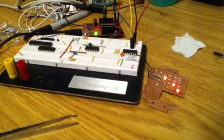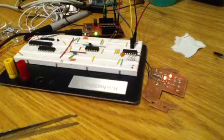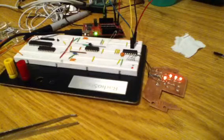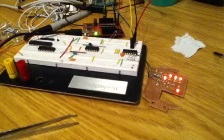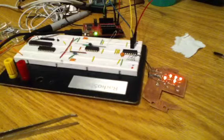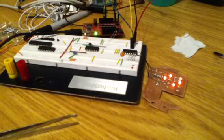My second version design, which was to fix the problems that I was having with this board, allows you to configure it to show either Arabic numerals or letters on the display. This is an LED matrix display, but I wrote my own font to be displayed in 3x4 pixels, so it's able to be run on a display of this size. So you can display numerals, you can display binary horizontally, seconds, minutes, hours, or you can display only seconds, again horizontally, from right to left, top to bottom, so more like the actual Arabic writing system. Or you can display the simple binary like this, separated into columns for each of the parts of the time.